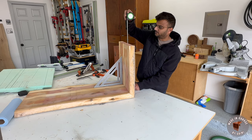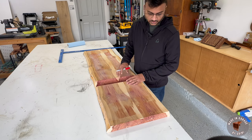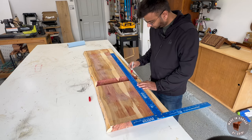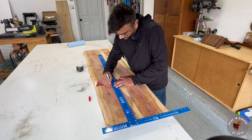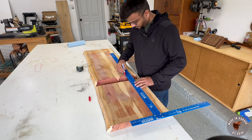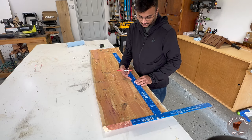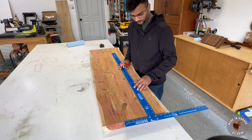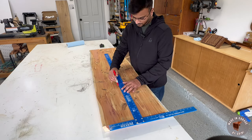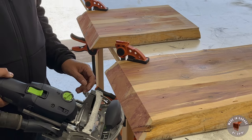This piece is exactly 19 and a half inches — I think it should be the same size for both pieces. I aligned both slabs so I can draw lines for the dominoes, and I'll be using dominoes to join these two slabs together. I want to have one domino every two inches so I'm marking rough lines. I'm also drawing lines on top of the slab to act as a reference during the glue-up — rather than checking if the grain is matching I can just use the lines as reference. I'll test just one domino on each slab first to see if everything fits before drilling the rest.